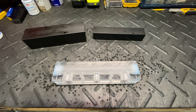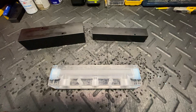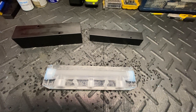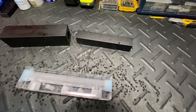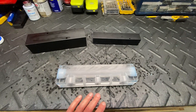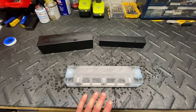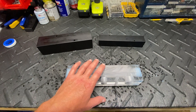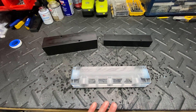I spent 45 dollars on that acrylic block and I'd never order another one. There are some guys out there using polypropylene blocks — I think those are probably going to be fine, no issues. Our aluminum blocks have mounting holes so you can mount the block to something. These acrylic blocks, in my opinion — no. I don't think they're worth the hassle. If you're going to save 50 or 60 dollars on a proportioner by using an acrylic block over aluminum or poly, I'd say that money is not well spent. Alright guys, it's Friday — have a good weekend, and we'll talk to you next time.